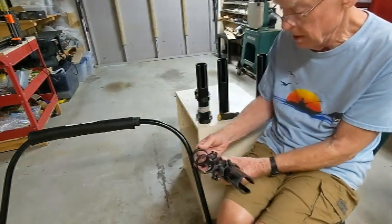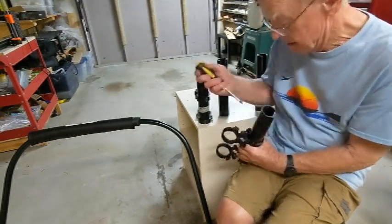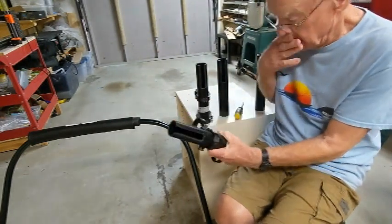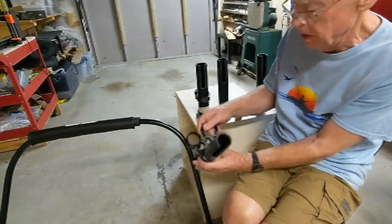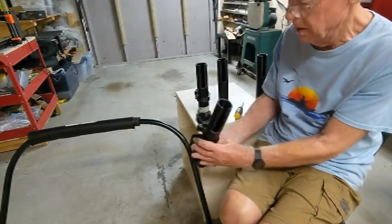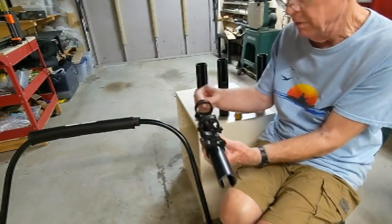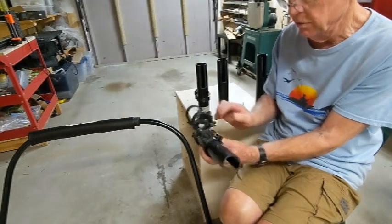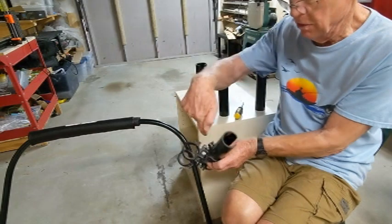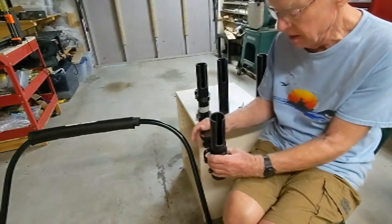The first step is simply to remove the screws on the hinges, which allows them to open up. I've preset this so that when closed and clamped onto the stabilizer bar, this set of holes and that set of holes kind of align — it looks like they're straight up and down. You'll notice the holes for the stabilizer bar are offset, and that's to account for the slope on the stabilizer bar. That's the whole point of these.